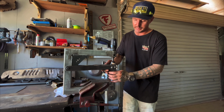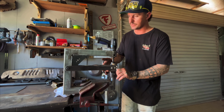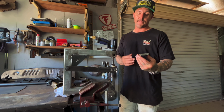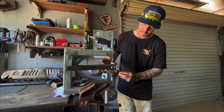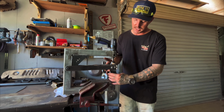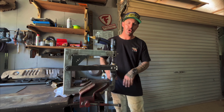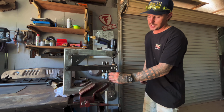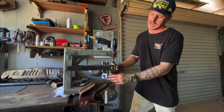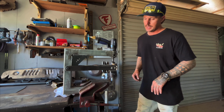Today, we're going to be doing these top and bottom dies sections in here, shaping them and getting some shape into some steel. 13 mil thick plate off an engine stand I had. Two bolts holding the top one in and one for the bottom. That is sitting on another plate that's welded in this tube. So that's extra. The bolt is purely just to keep it in line with the top one. But it will be hammering on to flat steel underneath.